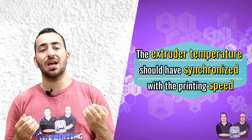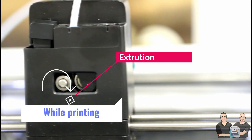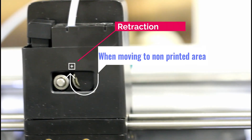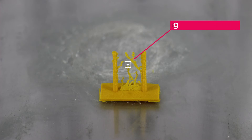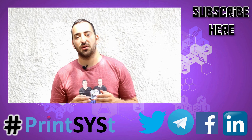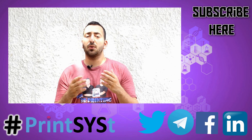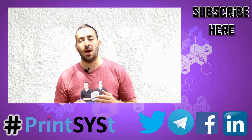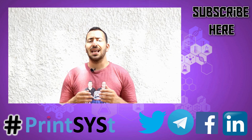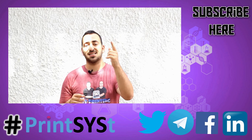As mentioned, you need to adjust both temperature and speed accordingly. There are more extruder terms, such as retraction. Retraction means that the extruder retracts the filament when moving to a non-printed area — for example, it can prevent stringing. And that's it! I hope you liked this quick lesson about the extruder and found it helpful to know what goes inside your 3D printer. Make sure to subscribe to our channel so you never miss a video from the 3D Printing Experts. Don't forget to like and leave a comment so we know what topics you'd like us to cover. Thank you and see you next time!